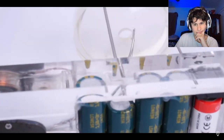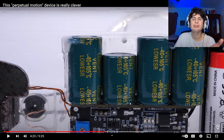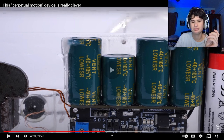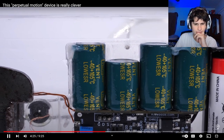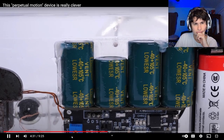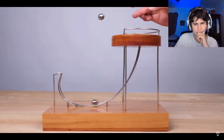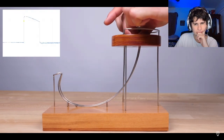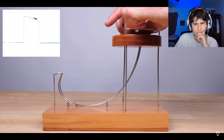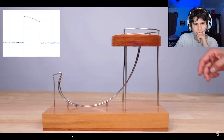Final couple of things I want to look at. These are capacitors — you really need to give that electromagnet some juice. So instead of powering it directly from the battery, you charge up these capacitors and then power it from them. If you send two balls down at the same time, the second ball doesn't make it. But if you leave a little gap between the two, then they both come back to the top. Looking at the voltage graph from earlier, the capacitors don't discharge very much at all — so it wouldn't take much time to recharge them before the next ball arrives.